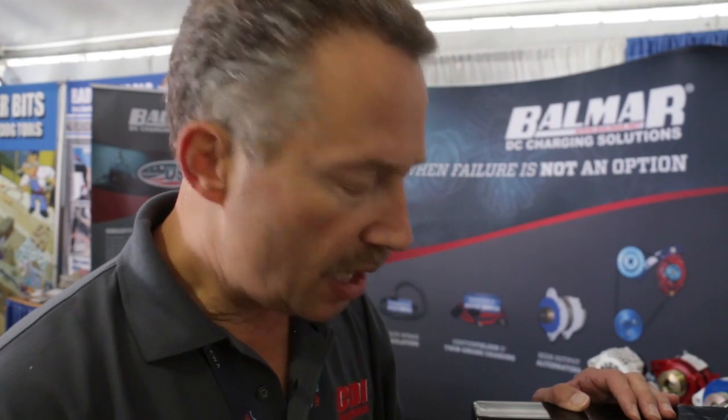First of all, installing a shunt is an expensive and time-consuming approach because you have to crimp your battery cable. Not everybody has the tools to do that. You need professional help to get it done. Number two, when you're counting amp hours, that requires that you know the capacity of the battery bank, which means you have to recalibrate on a regular basis as your battery bank ages and its total capacity changes as well. Thirdly, accuracy is a problem. The Smart Gauge is known to be, and tested independently to be, 97% accurate after 3 charging cycles or more.